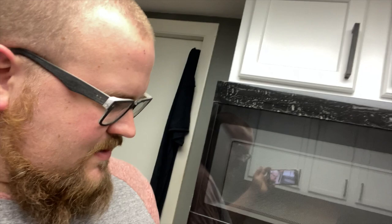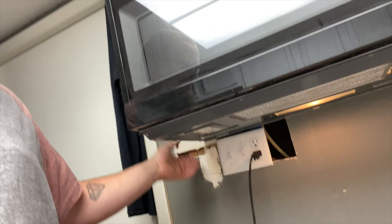And when I say a makeshift stud, I mean just get a 2x4. I could cut a hole somewhere and slide it down in there. That way I can screw it into the drywall, and it's going to basically use that whole piece of wood as a bracket, essentially. So it'll be a lot stronger, and give me room to work with this crap right here, because this just looks terrible. It was such a quick, let me slap this on and that should work. No, I need to do it the right way.